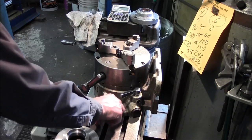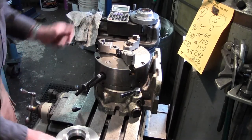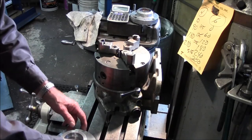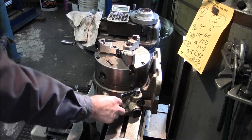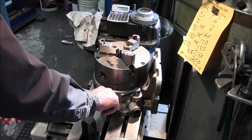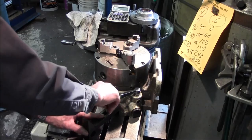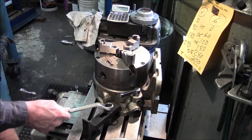We're going to pull this bolt out of here, set it off to the side, and put a toe clamp and block over here. And we're going to throw a washer up there, so we're not just clamping down on that open mouth there. Just like that. There we go. It's a little better clamp, and we're not destroying anything.